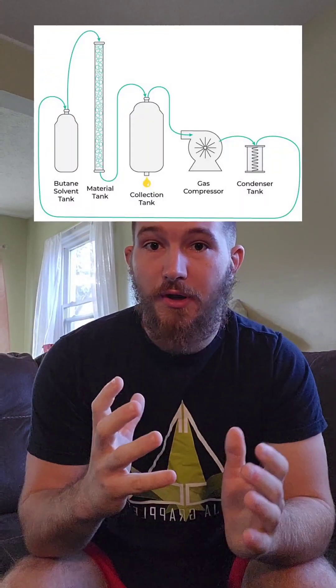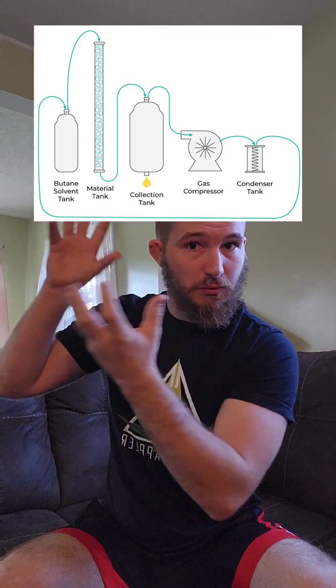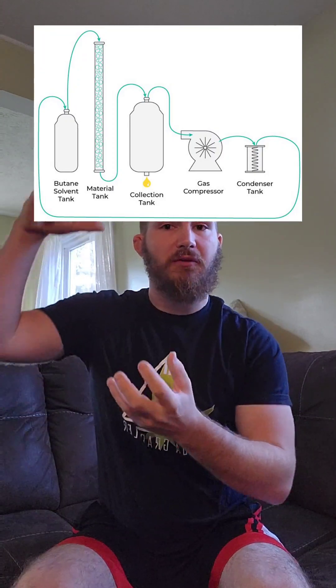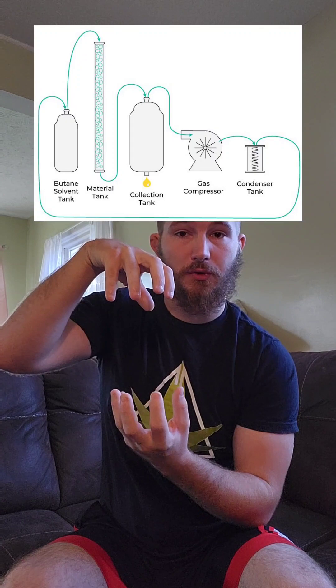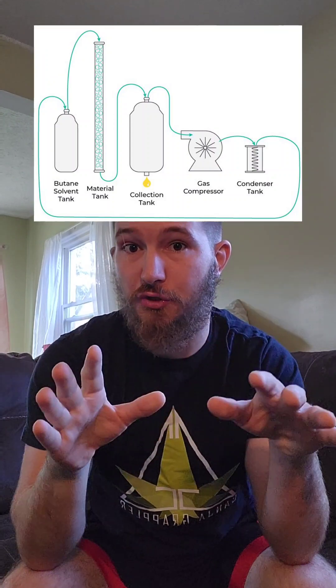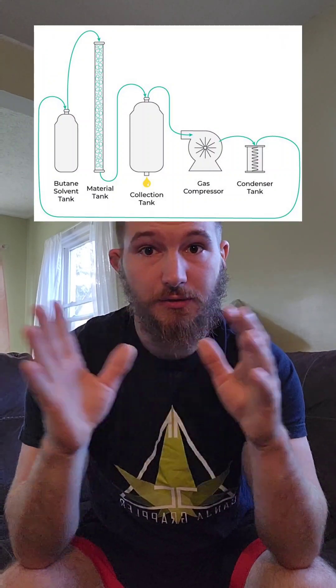Starting off, CRC stands for color remediation chromatography. It's a remediation process that changes the color of your concentrate, specifically in a hydrocarbon extraction setup. I'm going to show you a picture of a hydrocarbon extractor setup. As you can see, you have a source for hydrocarbon — whether it be butane, propane, or whatever — as your hydrocarbon. You have columns where your material stores, and then you flow that over it. You have a collection column, and this is how a traditional setup is arranged with basically just those three columns.